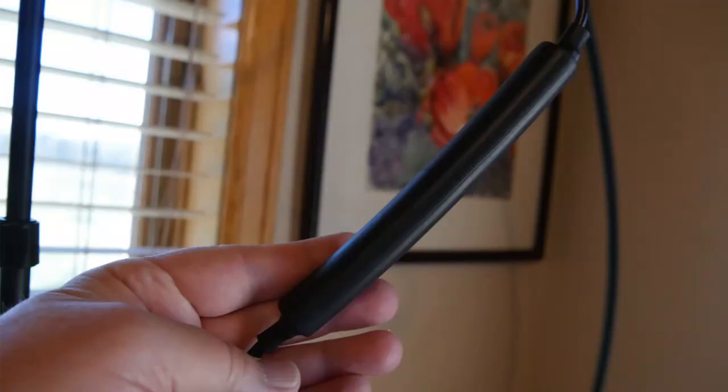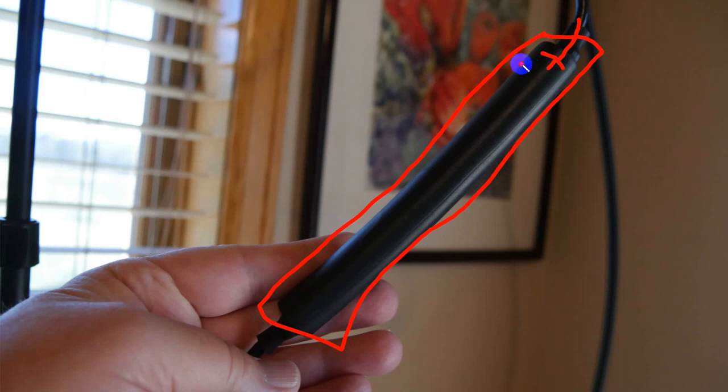This is with a very nice little portable loop antenna that I just tested recently. Inside here are a whole bunch of ferrite beads — little ferrite beads. Every time you get coax going through a ferrite bead, it's going to add a little inductance. Just a single wire through is a one-turn coil. They just add a whole lot of these little ferrite toroid beads, and this also acts as a choke balun — we're not doing any impedance matching here at all.